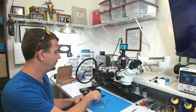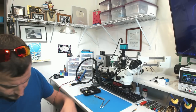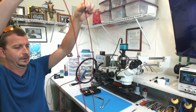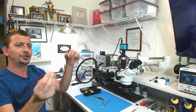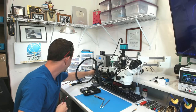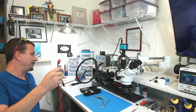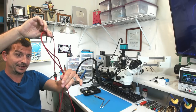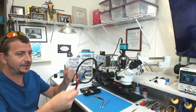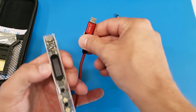I'm going to try it first on USB-C and see what happens. I do have doubts about delivering sizable current across a USB-C cable — this is not an actual USB-C supply, so it's only going to be delivering 5 volts, whereas USB-C has the ability to go higher than that. Let's see if it's capable of making this thing power on.